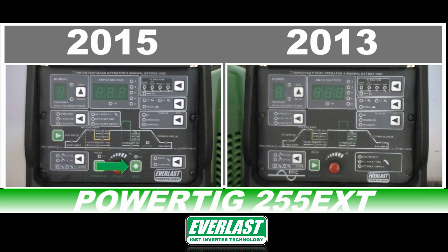To the right of the parameter adjustment control, a special spot weld timer feature has been added. With this function, the user will be able to make perfectly timed spot welds, improving penetration and consistency of tack welds in sheet metal spot welds. An additional light has been added to the TIG weld cycle graphic on the panel so that the spot weld parameters can be set using the select button. Note, not all controls will be usable with the spot weld timer — it will only work with the 2T or pedal 2T function.